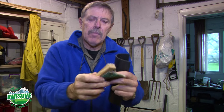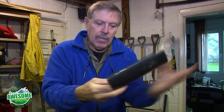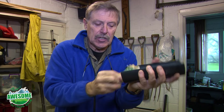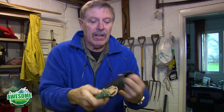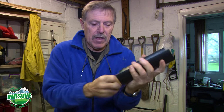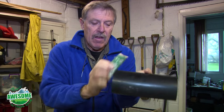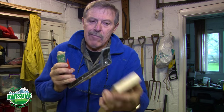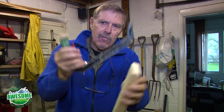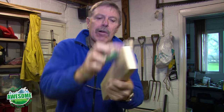When you've got the drain pipes done, you're going to find little rough edges around there. Get yourself a narrow piece of wood — a circular piece would be better, but this will do the same thing. Wrap it in sandpaper and just rub off those round edges; take the edge off the plastic and you'll find it's nice and smooth. You won't snag any bits of clothing. For your bits of wood, any saw-cut rough edges — take off a very slight chamfer with either a rasp or coarse sandpaper on a wider block of wood — and generally clean it all up.